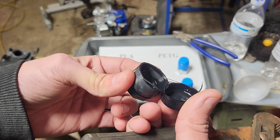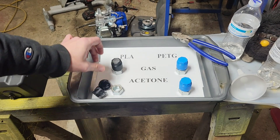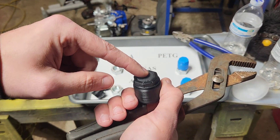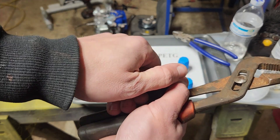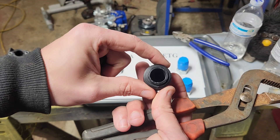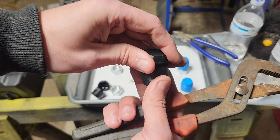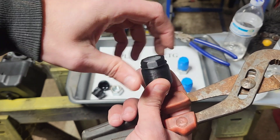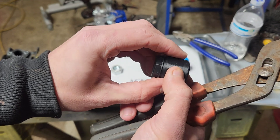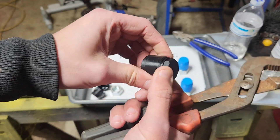The interesting note is it didn't really smooth the inside — I can still see all the printing lines. So there's acetone, and here's gasoline. Previously, this would open at the 8-hour mark. It still opens. The gasoline did not react with it as much — we can see the gasoline is still in it. Out of curiosity, I can get the cap back on. Yep, it hasn't warped. That's still very solid — there's nothing about that. That's all nice and solid.